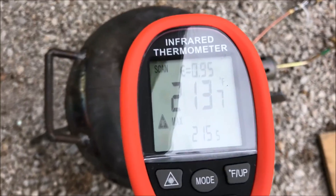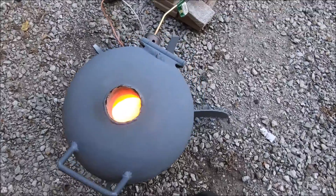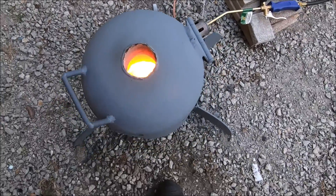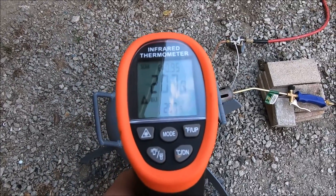We're not there yet. We'll run this device for a little bit longer at these temperatures — that's pretty much about the max I'm going to get right now. We're going to put on the reflective refractory coating, the high-reflective coating that's supposed to increase the temperature of a foundry, and put that to the test to see if we get higher reflection and hotter temperatures. We're back up and running, and already in about 20 minutes we're up to 2,000 degrees. So this stuff is definitely doing something, definitely kicking off some powerful IR.